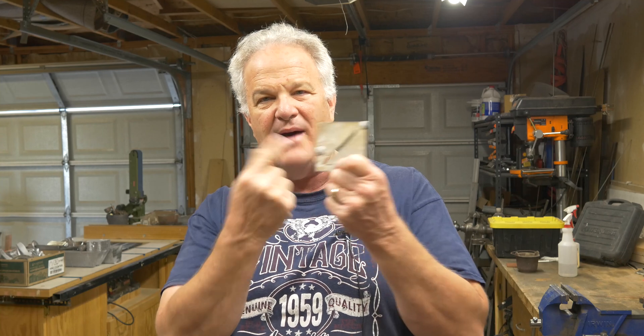They're so much easier to clean up. This older part is probably still sitting here because it's such a pain — not only do I have to cut the edge smooth, I've basically got to plane the whole back side. Make your life easier: look at doing wire pokes, look at scratch vents. Your vents don't have to be huge. Keep in mind your sand is semi-permeable — some gas is going to come out through the sand anyway. Hopefully that was helpful and will save you some effort. You guys have a great day.